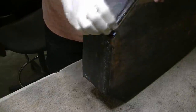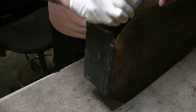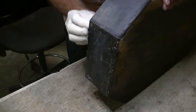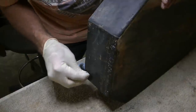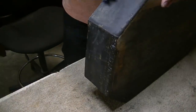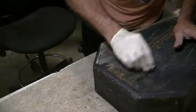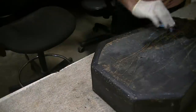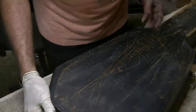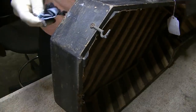The customer does not want this to look like a new case — he doesn't want it solid black and shiny or anything like that. He really wants to keep the old look, and I'm just trying to make it look like a well-cared-for old book. I'm pretty sure it's going to look old regardless of what we do here, but I may have to go through it with a little paintbrush and touch up those little white specks in the low areas. That white filler does take the stain real well where you can touch it, but down in those deep cracks I'm obviously going to have to go back and touch that all up.